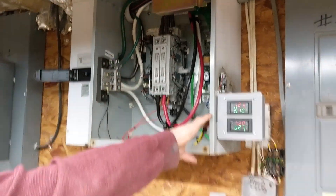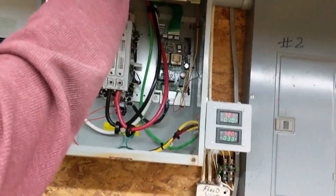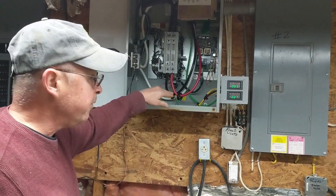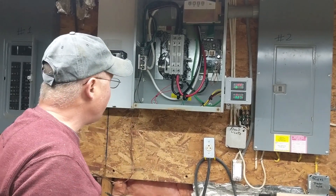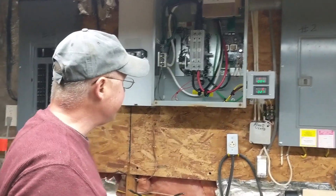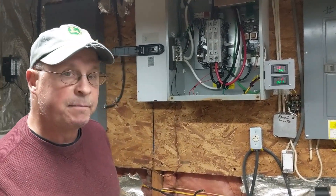Back inside, here's my low voltage. Low voltage goes through this one-inch conduit, and the high power goes through the two-inch conduit. For anyone wanting to do this, playing with these 1/0 wires is hard work. They're copper wires — physically very heavy to run — and they're hard to bend.